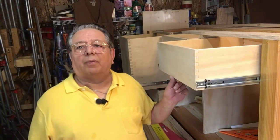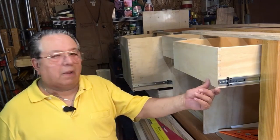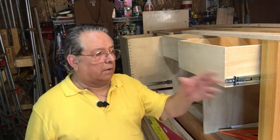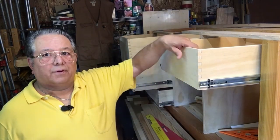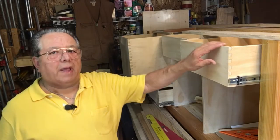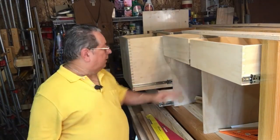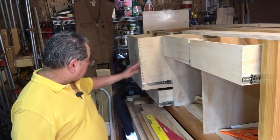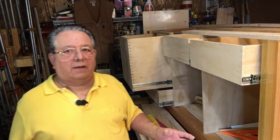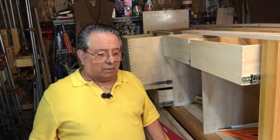Don't tell anybody, but I used putty. I'm going to say don't use the putty, but I blocked them up and sanded them. I sanded them all real nice, and I'm going to put urethane on all these tomorrow, and then I've got some interior work I'm going to do. I'll show you that later. I edge banded all the tops. They're all edge banded, nice. I think it came out really well. Again, I can't say enough about William Ng's system for box joints.